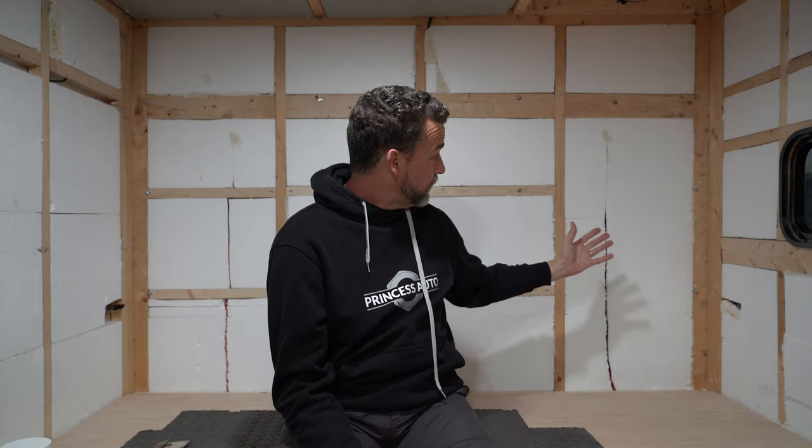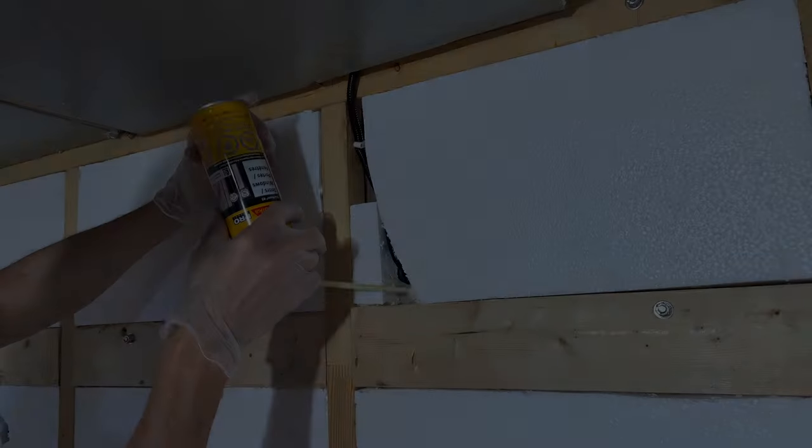And the plan is that it will be one solid panel that if I needed to remove it, it would come off in one piece without destroying the shiplapping. Now, eventually there will be cabinets above here and probably a few other things. So if I ever needed to take it off, it would be a bit of work. But I do believe it would be less destructive if I had just had to take off an entire panel. So when you see me putting the plywood on here and then the shiplapping, that's the reason behind it. So just wanted to share the plans with you before we started, and let's get at it.